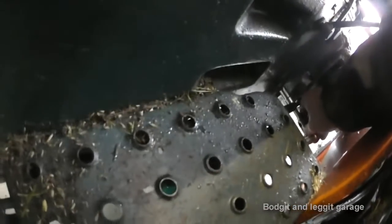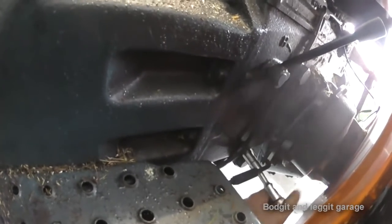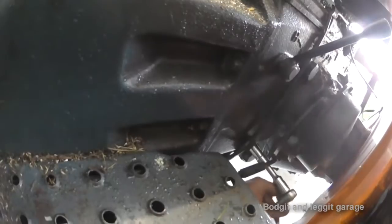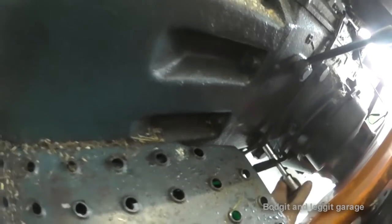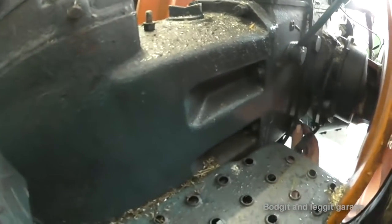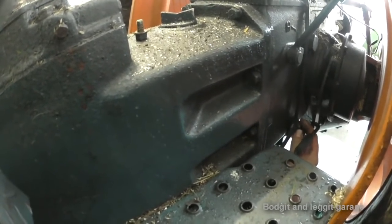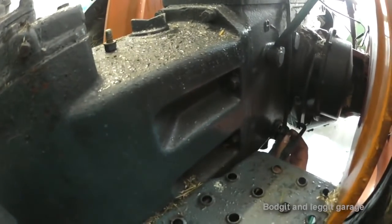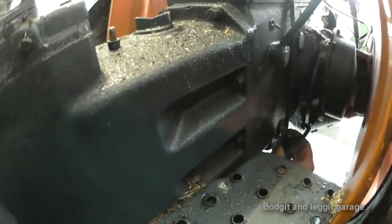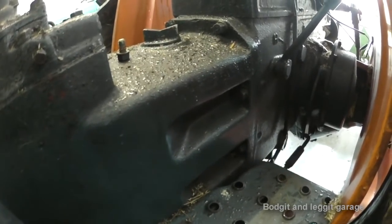There we go. You got me bucket underneath, Delilah. That fluid looks kind of clean so far. That's not a good sign, because it means we might have issues with the pump or the valves if this filter isn't really, really bad. We do have the spring, so we do have the wrong filter. The filter we have is wrong.